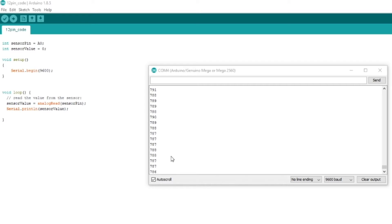It's hit our maximum value of 1023, which is as high as it will go. I also want to note that the readings are not always exact — it does fluctuate a few points around where it would normally sit. So if it's 750, it might go to 748 or up to 753. You just have to keep that in mind when writing your code if you want it to trigger from something.